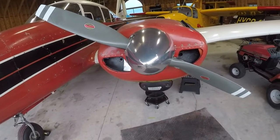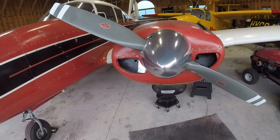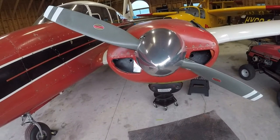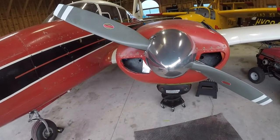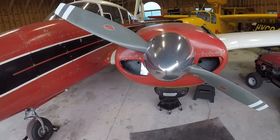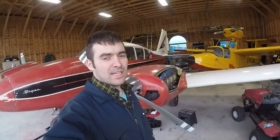There's quite a lot to do, but it's a really amazing difference — it really changes how the airplane flies. This engine had about 45 grams of weight put on to balance it out and you can feel it on the ground. Once we get in the air, just like all the other aircraft I've done, it's going to be a massive difference. Not having all that vibration means you're not wearing out your exhaust, engine mounts, or cowls, and you're going to make all of your aircraft components last much longer.